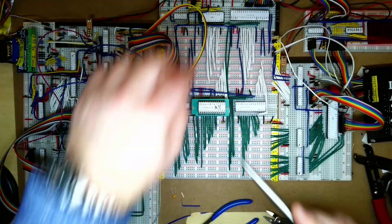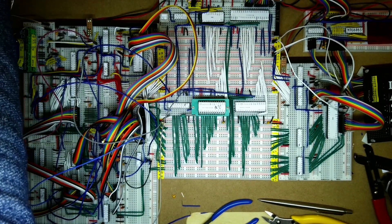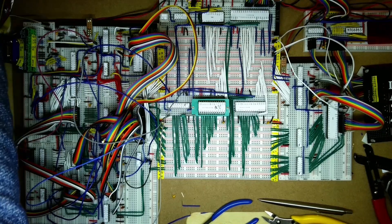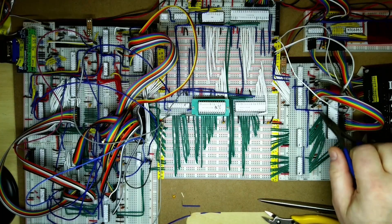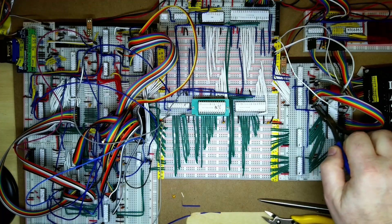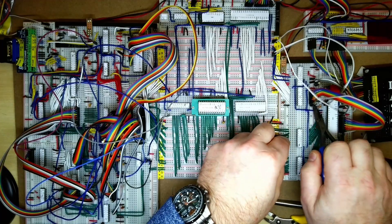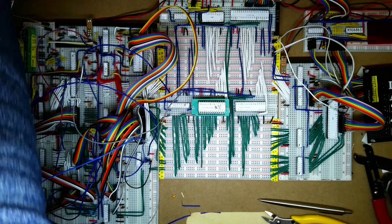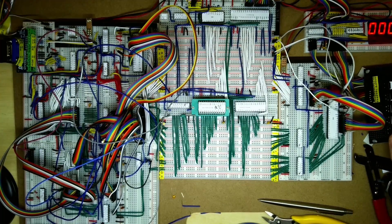Checking the values on the PLD definition for the address decoder, then hooking in the PIA and serial adapter into the Y4 and Y5 lines. Hooking in the Q signal and the E signal. Most of the rewiring is done - swapped the RAM chip over and shuffled things around, hopefully getting all the lines back in properly. Still got a few fly leads for the video card since we'll sort those out later. Just need to remember the dot clock too. Turning it on to see if it runs - and there's a problem: the D7 line has become unplugged during all this excitement.